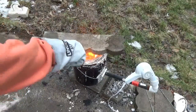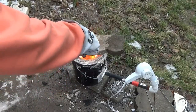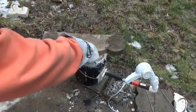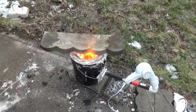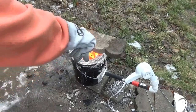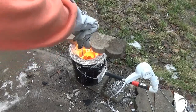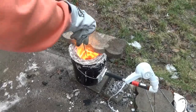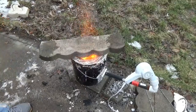At this point it's very, very soft — almost to the melting point — and I thought we were almost done. But then I started getting huge chunks of charcoal falling in from around the crucible. I let it burn off a little bit, but right there was about the time I was closest to having a puddle of molten copper. You can see the amount of charcoal that fell in.